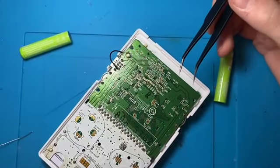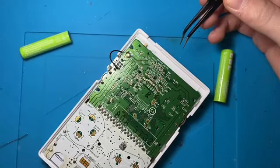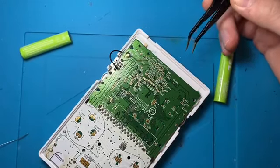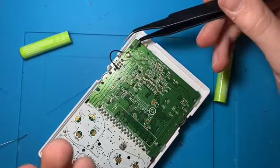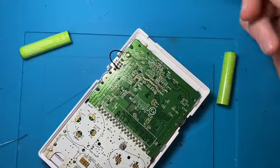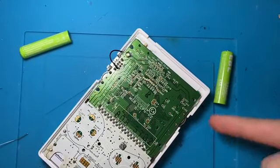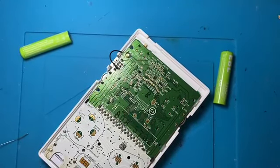I fixed the touch sensor already, and that was really the only two problems with it. The touch sensor just wasn't fitted correctly, and there was a small broken trace on this power LED, which I have fixed just with this small wire. I'm going to do a time lapse of me reassembling this now.